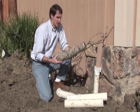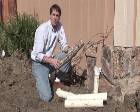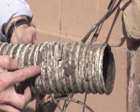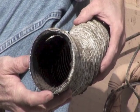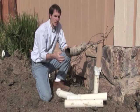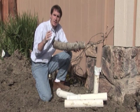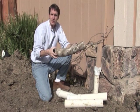What you see here is some old corrugated pipe — a product I've never cared for. I find it a lot in older jobs. This job being redone had it in the ground, and you can see why we don't use it: it's been partially crushed and rips pretty easily compared to PVC pipe. Also, the inside corrugations trap debris instead of letting it flush through with the water. It builds up and reduces flow. It's also harder to get a good slope because it's flexible and tends to undulate in the trench, trapping water and moving it less efficiently.